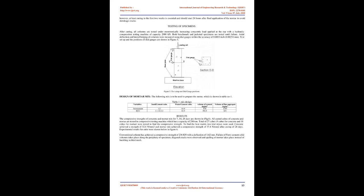6 samples from each group were hand chiseled to obtain a rough surface. After surface cleaning, 3 columns were confined with 1 layer of steel wire mesh and 3 columns were confined with 2 layers of GI wire mesh in each group. Ferrocement jacketing: RC columns were jacketed with different types of ferrocement jacketing after 7 days of casting. Final size of jacketed specimens was 124 mm, including a 12 mm ferrocement jacket.